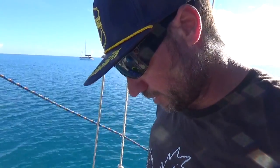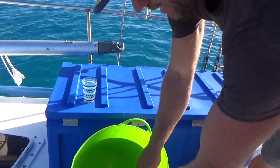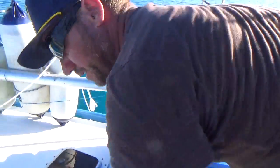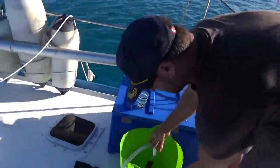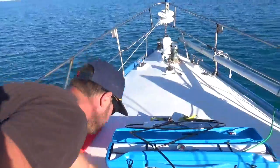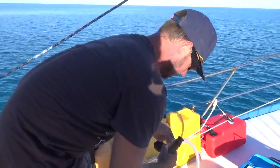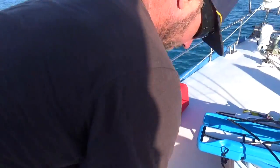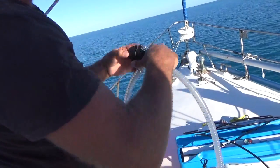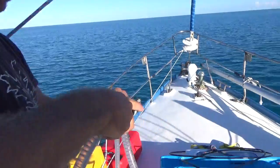It's probably about 15 litres — I recommend 10 litres. We run a little bit extra through because we don't pickle. We'll give that a couple of minutes. You can see it's just getting down to the last bit of water there, getting siphoned through. So before that runs out, I'll just turn that off. And on the line here — it's the end cap. Stop all that water coming back out.